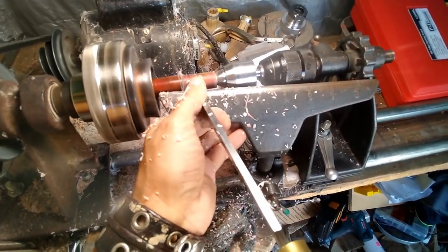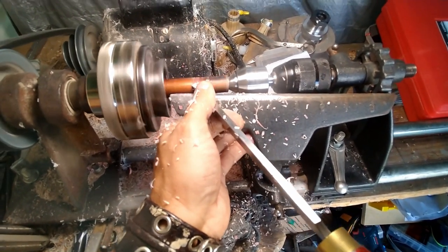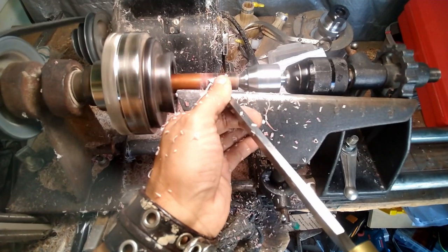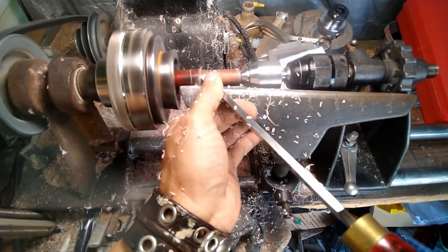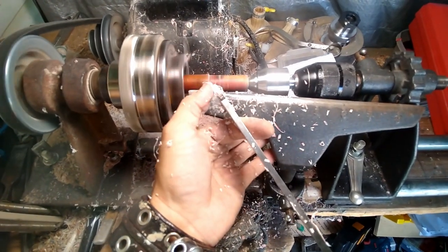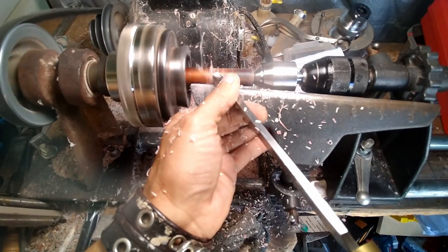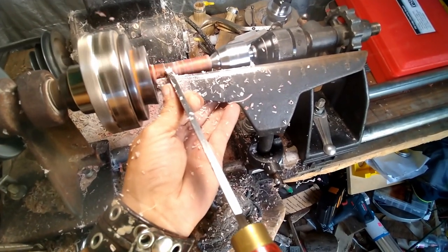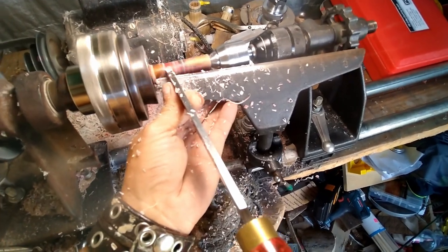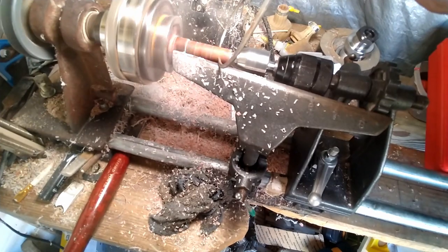And basically what I'm doing now is I'm using the parting tool, kind of like a little teeny tiny skew chisel. See how I'm going in at an angle like this? I'm just using that sweet spot at the bottom corner to clean up and remove material across the length of the piece. I will be investing in some of the mandrels just because they seem to make life so much easier and more enjoyable. We're going to check our calipers now and try a test.